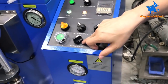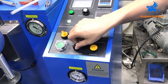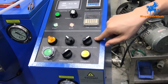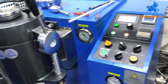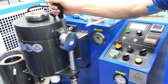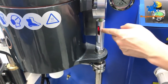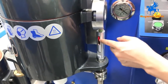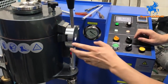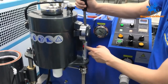Please note that for this switch, the overpressure is always on — open. This is on, this is on, this is off — we must keep it on. The protective gas is also always on. Because if the machine cover is off, the argon protective gas will not flow. We check whether this cover is sealed or not. There is one sensor here connected to the argon. If the cover is not sealed properly, the light will be off and the argon will not go into the machine. If the light is on, it means the cover is sealed well. Pay attention to this light.